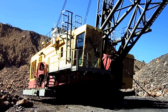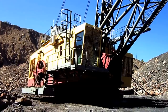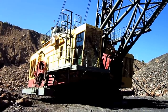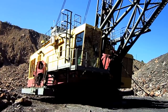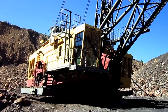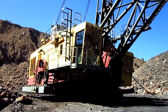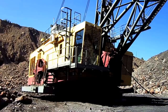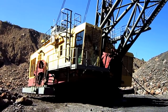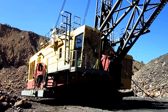Right here is a 1982 Bucyrus Erie 380W walking drag line. In response to the big coal boom during the 1970s, Bucyrus Erie first announced in 1977 a small walking drag line that was truly one of its kind. That machine was the model 380W. What made this machine so unique was the fact that it was built in module sections bolted together, allowing the drag line to be dismantled, moved, and erected in a matter of just a few weeks instead of a few months or a few years like a conventional walking drag line, which requires the sections to be welded together. This revolutionary design established Bucyrus Erie as the first drag line manufacturer to build a modular walking drag line.